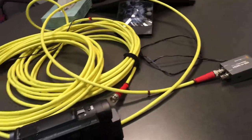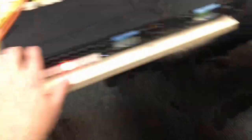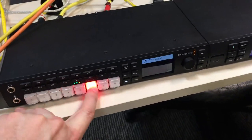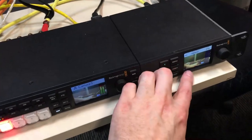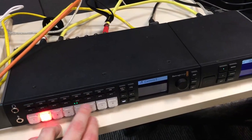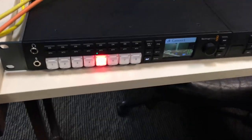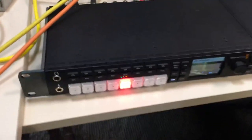So that's pretty simple - HDMI converted to SDI, SDI into a Vision Switcher. Vision Switchers are very handy because they allow multiple inputs and outputs. I've only got one input at the moment, but you'll also see the other monitor is following this monitor, which is where I'm selecting which source is going to air. This is a fairly new product from Blackmagic - capable of up to 4K, or it might only be HD - all by HDMI or SDI.